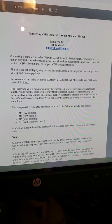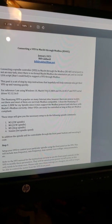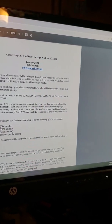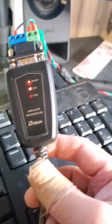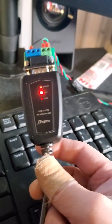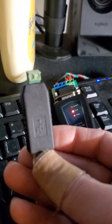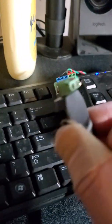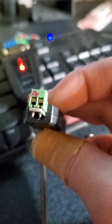Here's the document from Bill Caldwell. He and I were talking on email and he's helping me a lot to enable Modbus RS485 for the GT series. This is the USB to RS485 adapter — I got it from Amazon. It will work fine. This one doesn't have ground wires to plug in; you only have the RxD plus and minus.